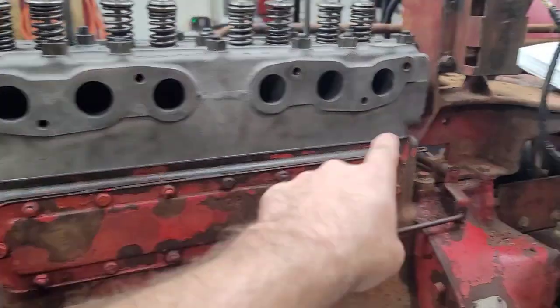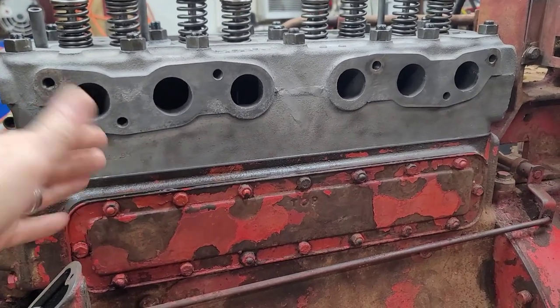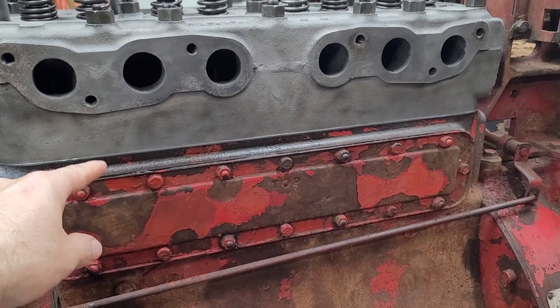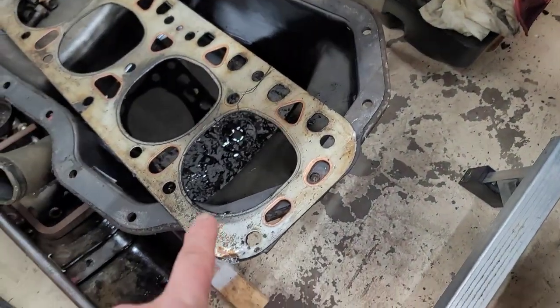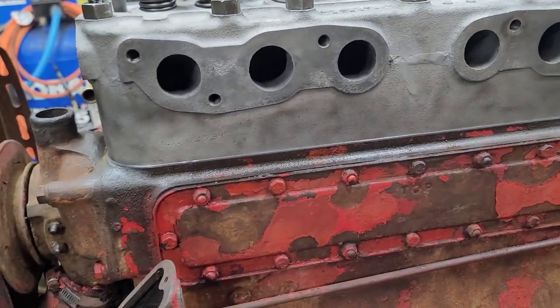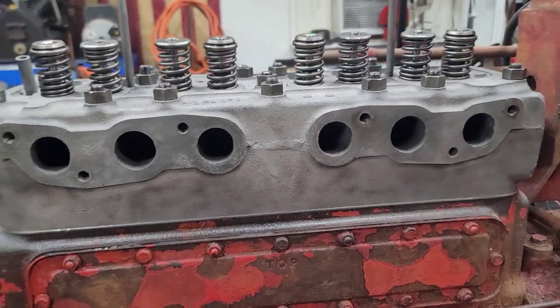What I told you was I just went ahead and sprayed the head gasket with the copper spray, both sides. Look for the area on the head gasket that says this end up. Actually, this one said this end down, I believe. It was the same style steel as this one. But anyway, I think it was this end down. So you put the proper side down. I set the head down on top. It went on there easy as can be.